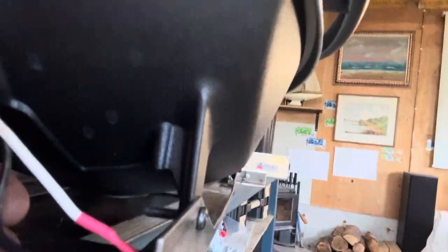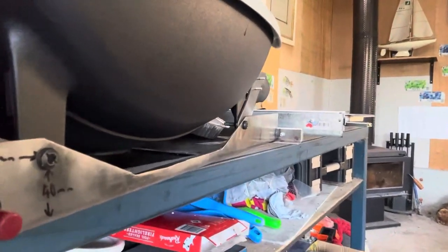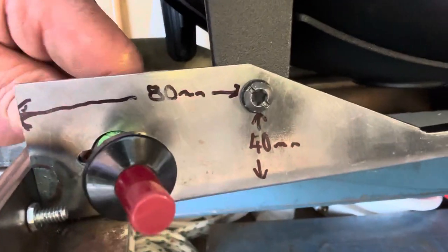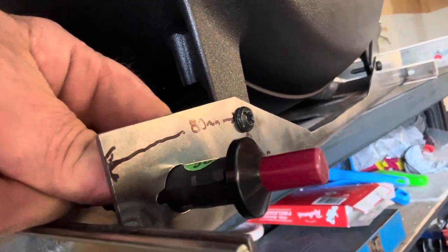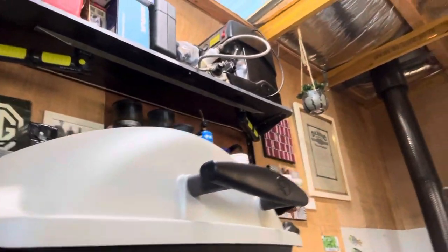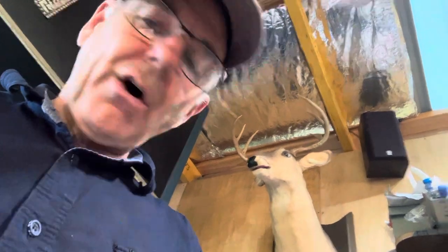The piezo ignition requires a 16mm hole to be drilled. The wiring just pulls off — these connectors just slide off. You're taking them out of your original barbecue. I had to cut a couple of slots at opposing positions on the hole, because the piezo has little expanding arms that open up when you get it into the hole and clip it in position. The hole was 16mm, and for the rest I mainly used 6mm and 5mm drill bits.